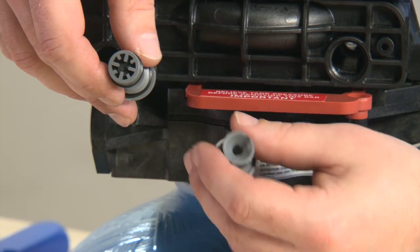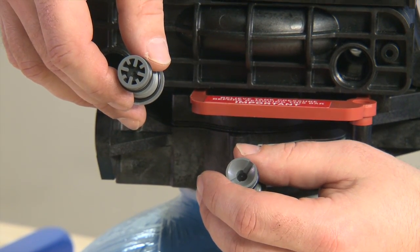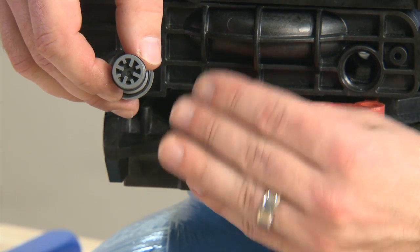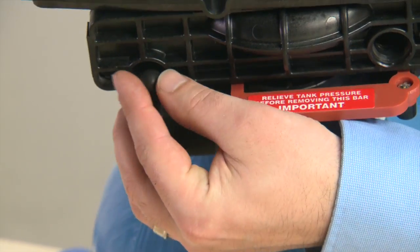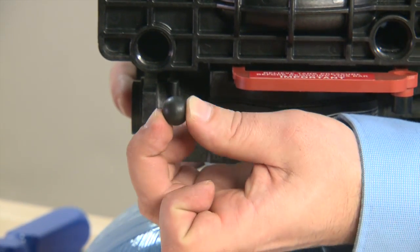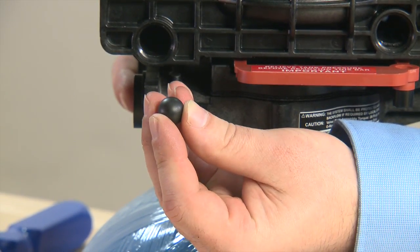This matches up with the correct amount of flow that would need to lift the bed up. Larger tank sizes may have the washer style, so we would want to make sure that if you have the washer style, you do not use a check ball. We want to check the condition of the check ball that is in the body to make sure it is pliable and there is no scoring on it.